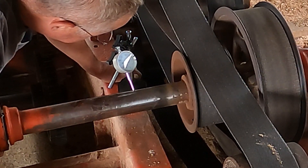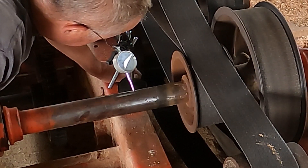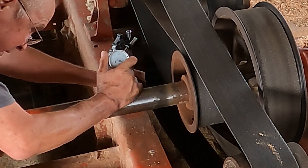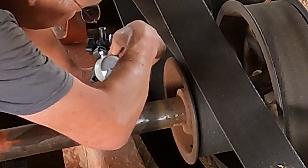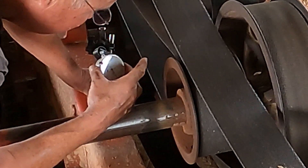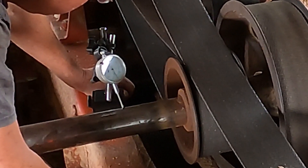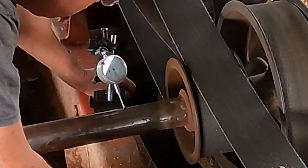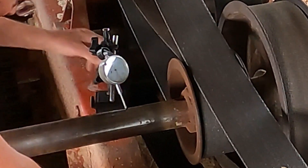Zero, zero, zero, minus one, minus one. Keep going. This thing is straight. Did you do a full revolution? I see some anomalies like minus three, but it's not — I don't want to tell you — it's not exactly. We'll put it to zero again. One, one, one, one, one. You moved up to two, two, one. This shaft is not bent. One, one, one. I am shocked how straight it is. That's amazing — it's within a thousandth of an inch.